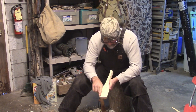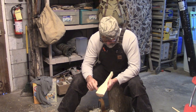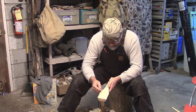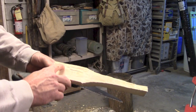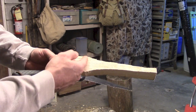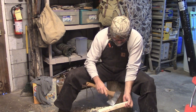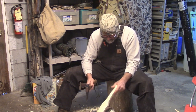The grain of the wood is running the length of our piece of stock. Here are the problem areas we want to look out for. If we begin to turn this over and want to take this stock off, we're going to want to make cuts here to stop the wood grain from splitting through our spoon. We're going to make a cut here and a cut here to the line, so that when we are removing stock in this direction, it's not going to split. If we don't put that stop cut there, it's going to split through our spoon. With the stop cut in place, we can begin to remove this material so the fibers don't run all the way through and split our spoon.